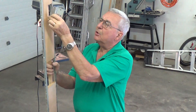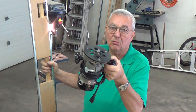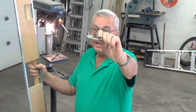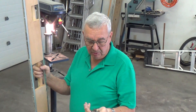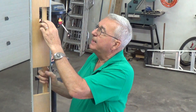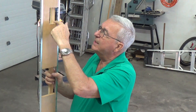This opening is a little bit more than the length of the hinge — as you can see, it'll move up and down. The reason for that is this is all routered out with a router, and I use a collar on my router. You'll have to do that, otherwise your router will just be out of control and you won't be able to do this whatsoever. I use this collar on my router along with a half-inch straight bit. The router runs right on top of this thing here — this is your running surface for your router. This is where your collar and your bit will go.